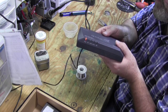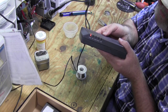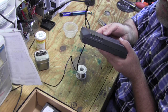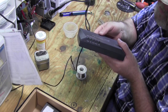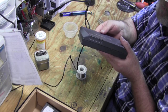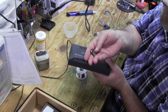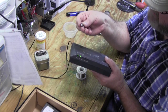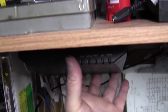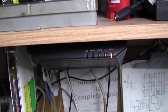Here we go — all looks better already. The orange light on the power LED is not turning red. Success — it's starting to flash green! The processor is trying to boot the DSL. I don't have it plugged into my phone line so it's not going to load the DSL, but it's definitely resurrected. Again, it was those two shoddy caps that were all the problem — could very easily have hit the landfill, but I saved myself about $80 for a new modem.